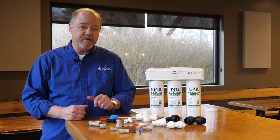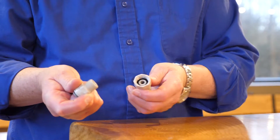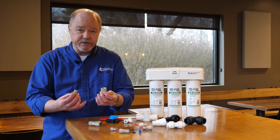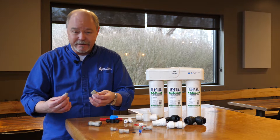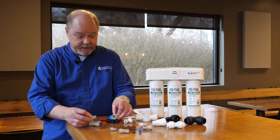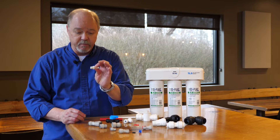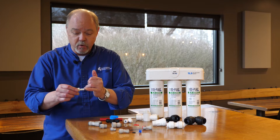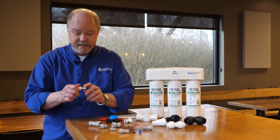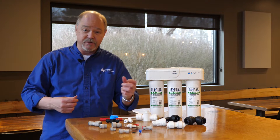The difference between male and female fittings is simply that the thread on a male fitting is on the outside, while the thread on a female fitting is on the inside. In the industry we use the terms connectors and adapters — they really mean the same thing. When I think of adapters, I typically think of something changing the venue, such as going from a thread to a quick connect connection, like a stem adapter with a thread followed by the stem. In all reality, they're all connectors.